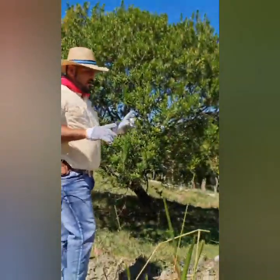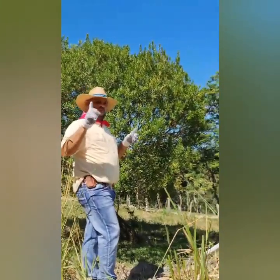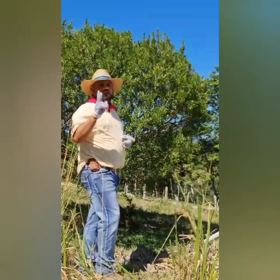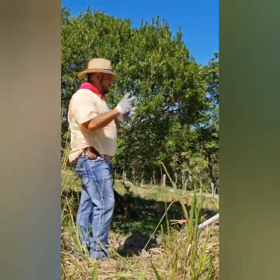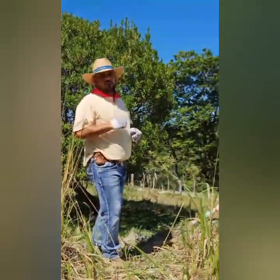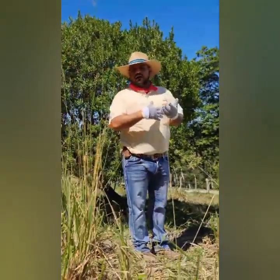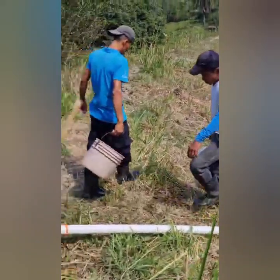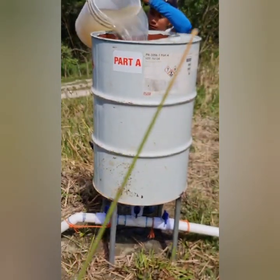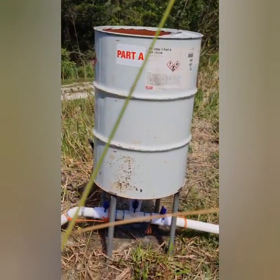The pipe width is 2 inches. We have already distributed 60 meters of tube. The height of the lagoon is 529 meters above sea level; we need a minimum of 528 meters for the test. We proceed to fill the pipe leading to the drainage. It is 92 meters of pipe total. We put water in the bottle.